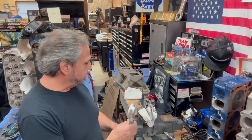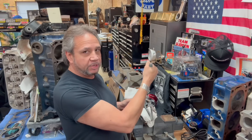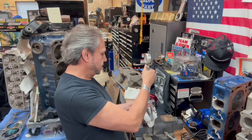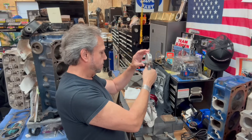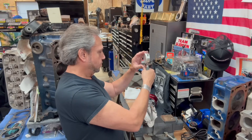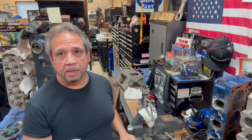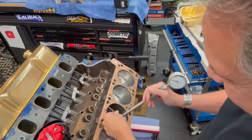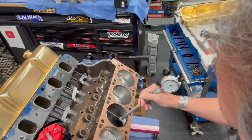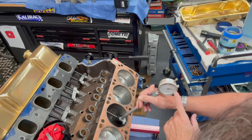Handle these instruments with care. When zeroing it you can't influence it by pushing back and forth — you want a light touch. I put the bore gauge between the anvils of the mic set to 4.0850, and that reads zero right there. Now let's go to the 354 and measure — put the gauge in the same spot you measured before to get the piston-to-bore clearance.